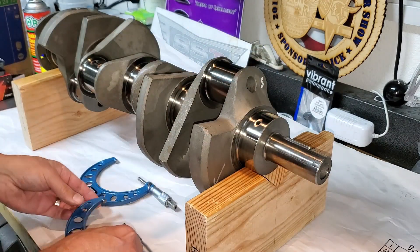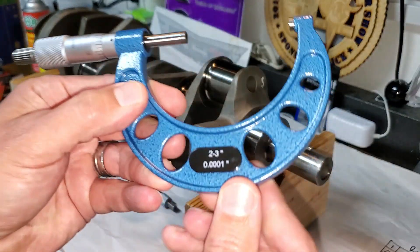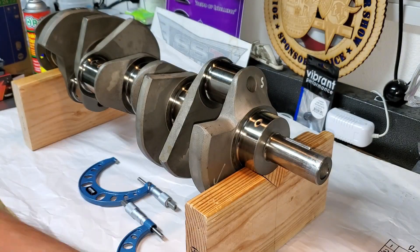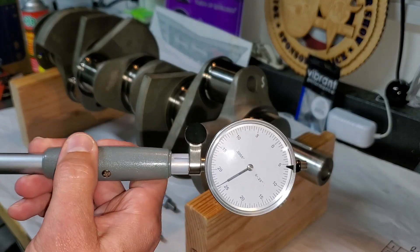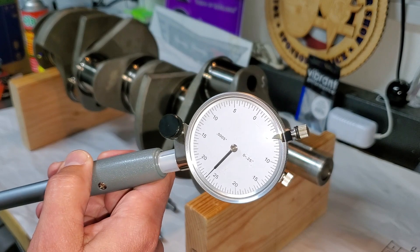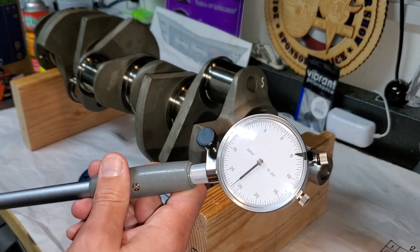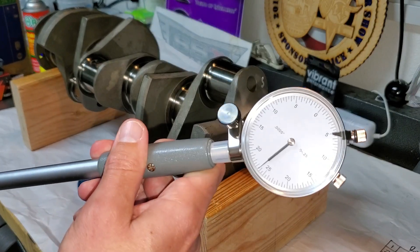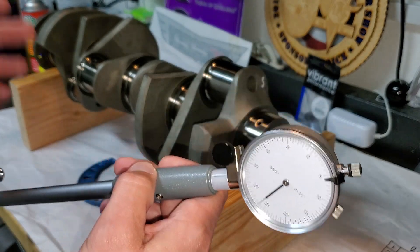The tools we're going to need besides the pen is a micrometer. The micrometers I have are down to one ten-thousandth — highly recommend that precision. Then try and get a dial bore gauge that you can afford. This one reads to the half a thousandth and it was about 80 bucks on Amazon. The really nice ones that read down to one ten-thousandth are like 350 to 400 bucks, so just be prepared for that.